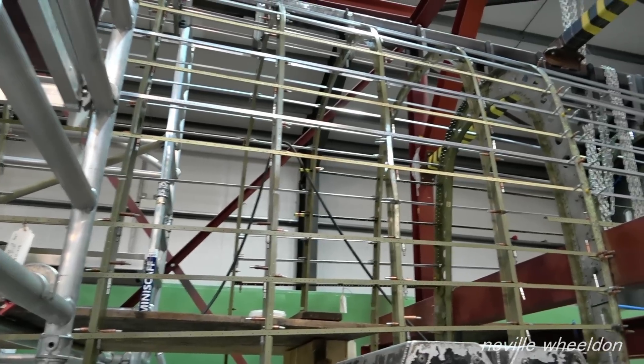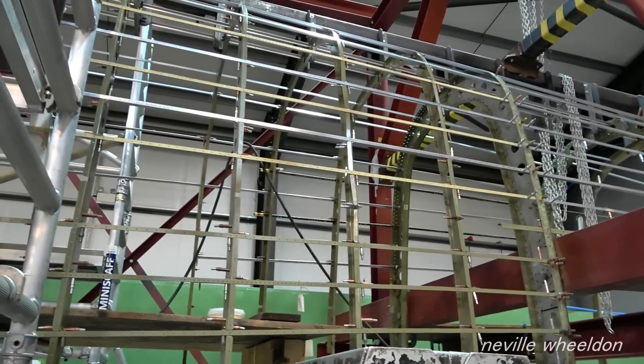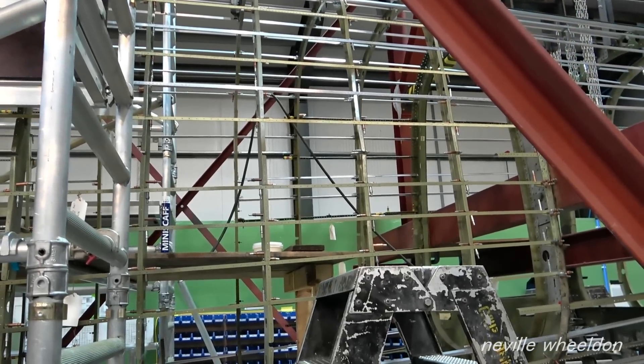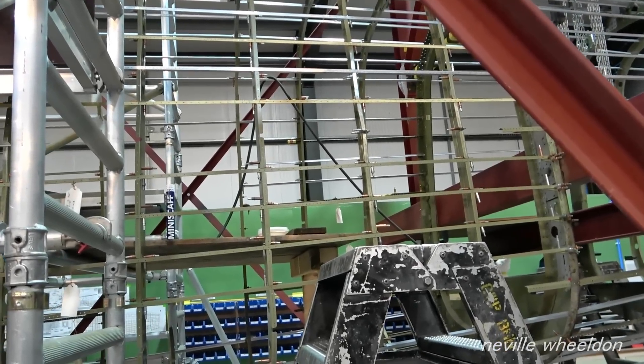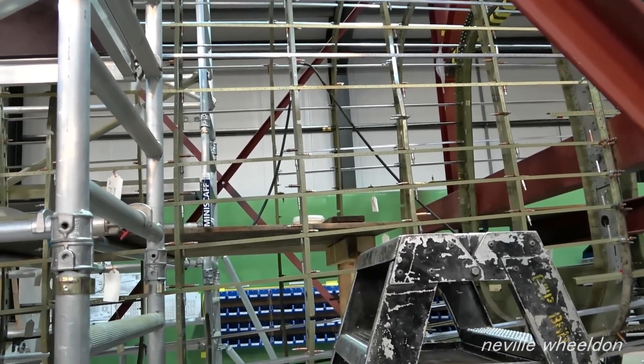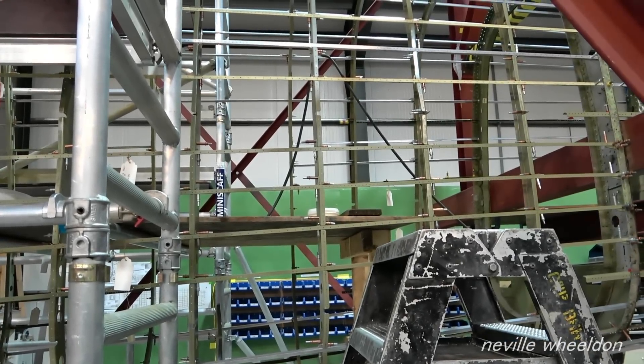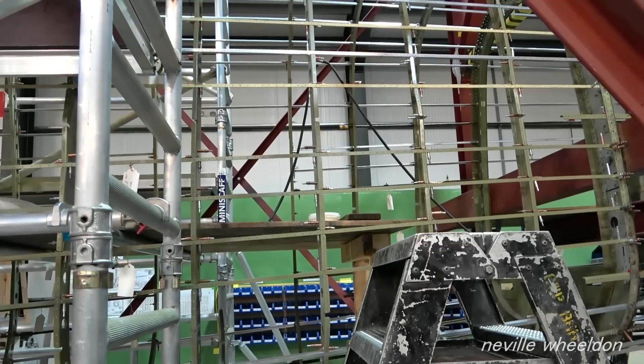The painted parts still need drilling out to the next size up — they've got the pilot holes in. They'll all be drilled at 2.4mm, and then when the skins go on they'll drill them outboard to the skin at 2.4 and go back 3.2mm the other way.